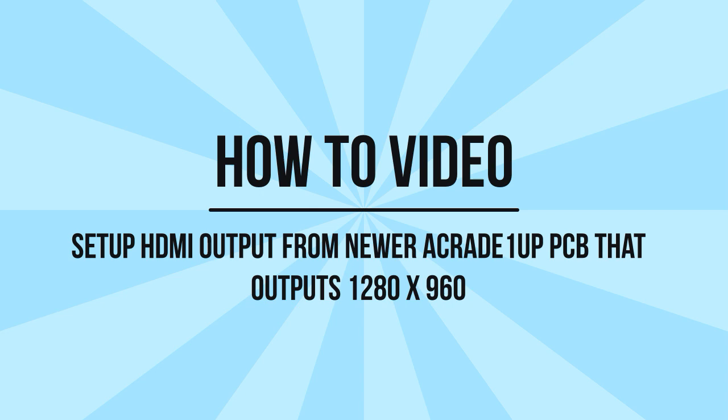So that's it. This is how to get HDMI output from your Arcade 1UP if it's running a 1280x960 monitor. This will not work with Gen 1 monitors because those monitors run at 1280x1024, and this LVDS to HDMI board does not accept input at that resolution. It will only work with newer Arcade 1UP cabinets that have the 1280x960 monitor. I hope you enjoyed the video — if you have any questions, put them in the comments below. Thanks for watching.